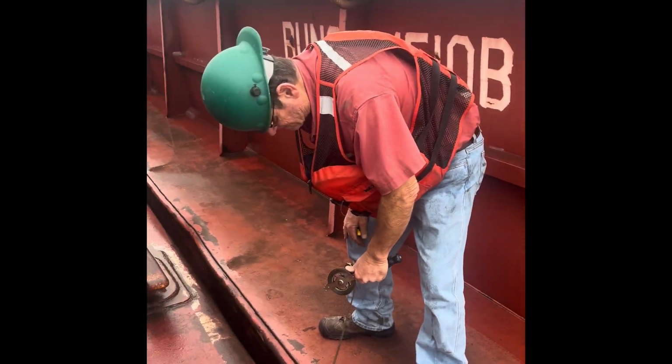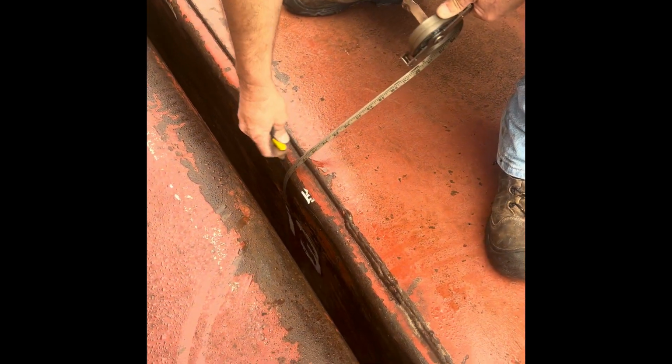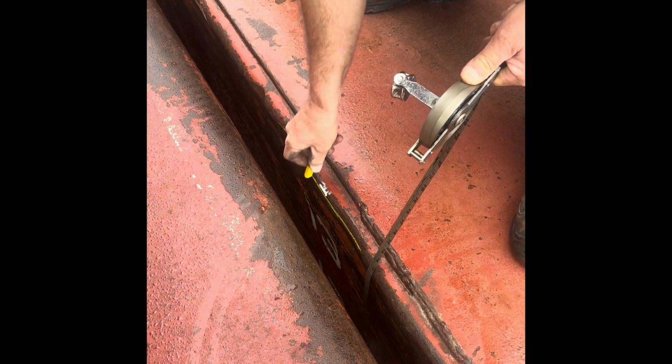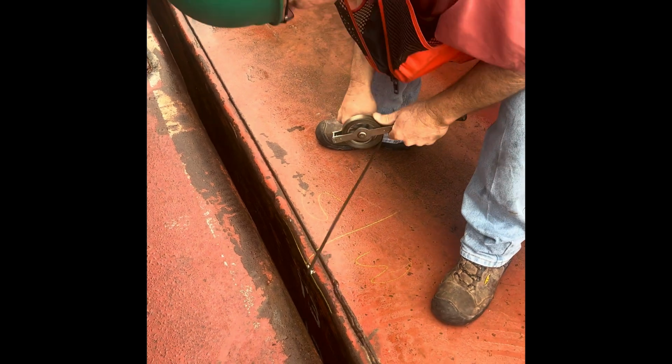Forward draft point. I'll come down from the bottom of the second number. Now, I mean 2 feet up from the bottom of the second number. Now make me a nice, bold, straight line. Make it into the M, T, S. Then we draft it. And that's going to come out to a 12 6.